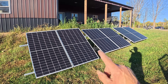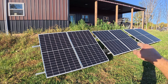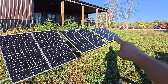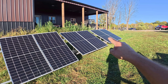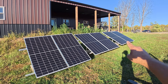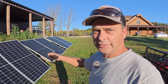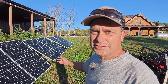Now that all three ground mounts are as close as possible to each other, we can connect the solar panels in series and run them back to the inverter. We can put a ground rod on each end to ground the solar panel mounts, then bond between the mounts, so everything is bonded and grounded. You could also mount a PV disconnect on the back of one of these solar panel mounts so you can turn it on and off. Other than that, that's probably all you'd need and you'd have a working solar array.